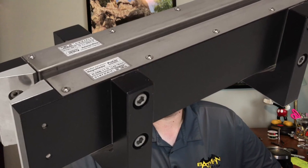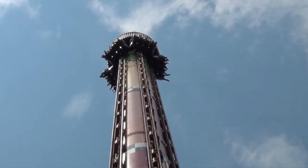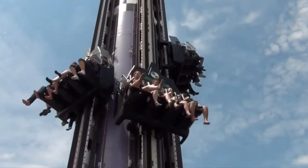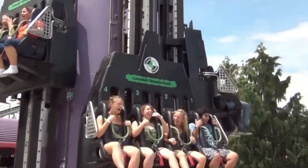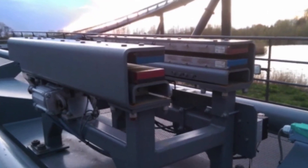The biggest advantage of magnetic brakes is that there's no contact. There's no clacking of brake fins, no worn-down brass that has to be repetitively replaced, and typically no wear on the vehicles either. So you've severely reduced the amount of maintenance to the vehicle, track, and structure. The magnetic brakes are much smoother and can decelerate the train quicker and faster than standard pinch-style brakes, so we're starting to see them pop up on pretty much everything.